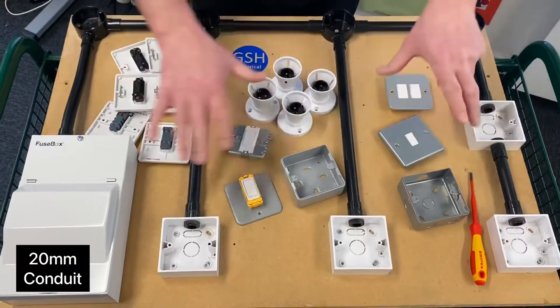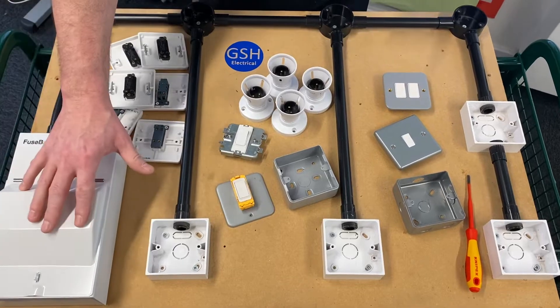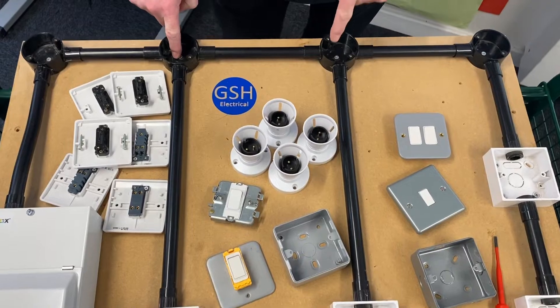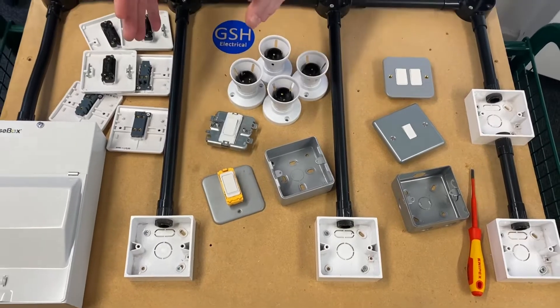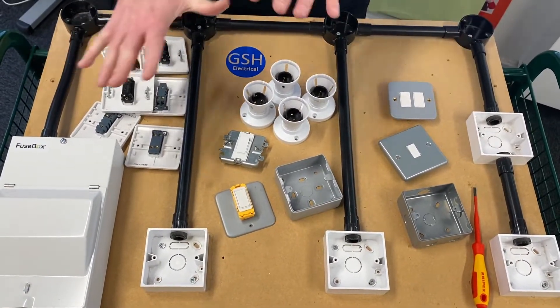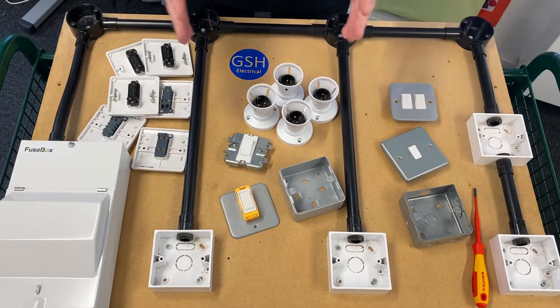I've added a lot of stuff onto the rig that's loose, so let's look at an overview of the actual rig that was built. We've got a consumer unit, and up at the top we've got an angle box, tee box, tee box, angle box, and four switching positions — exactly the same as the diagram downloadable in the wiring diagram playlist. So we've got all the flexibility of using four switches and four possible lighting points as we work through this series.